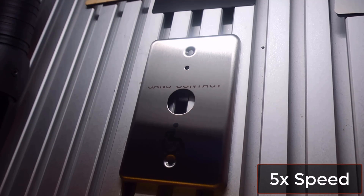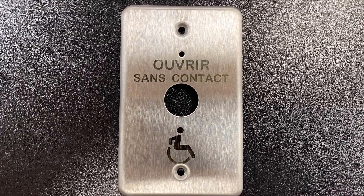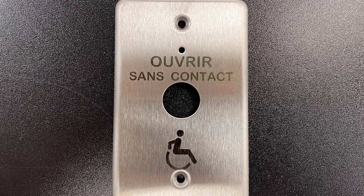On the stainless plate, we tried to find a setting that would produce a black mark faster than the standard fiber. We ultimately used a traditional annealing setting. However, when testing the final mark, we noticed that the single-pass mark was darker than after the cross-line pass. This would indicate that either the material or focus setting needed a slight adjustment.